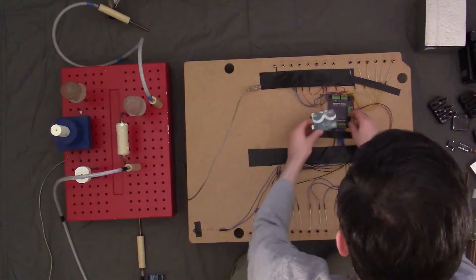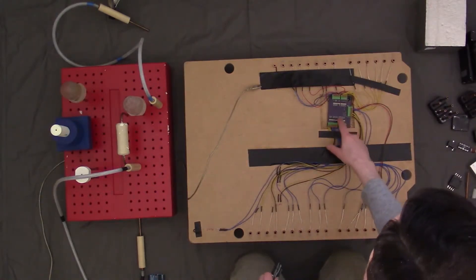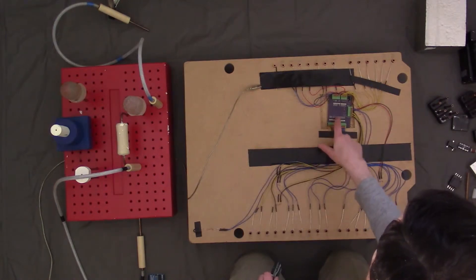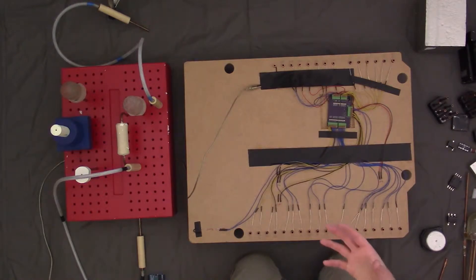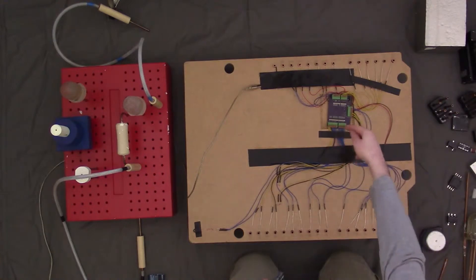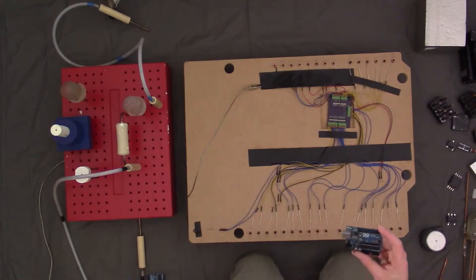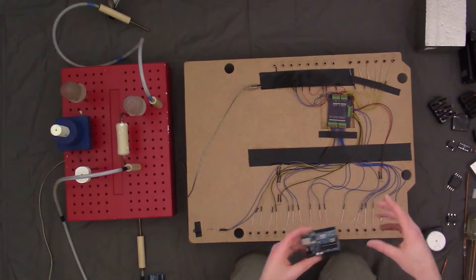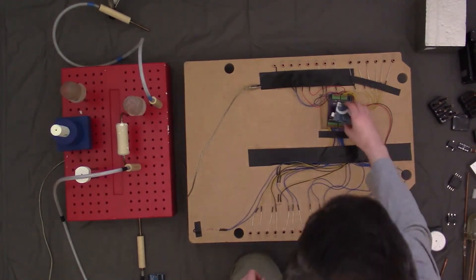The custom circuit board has protection diodes — TVS, transient voltage suppression diodes — and resistors. Because it's a development kit used as an educational tool, if somebody shorted the 5V to the ground rail, it would burn out the voltage regulator on the Arduino. So by adding all these protection diodes, it makes it much more robust for use in an educational setting.